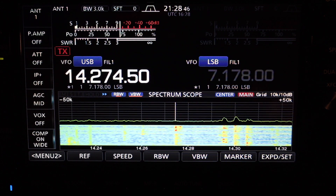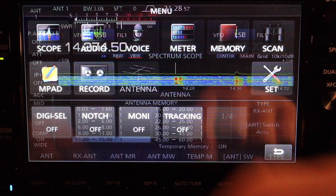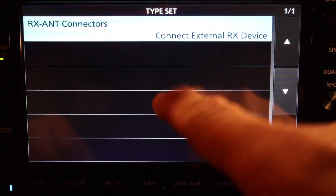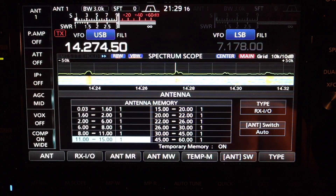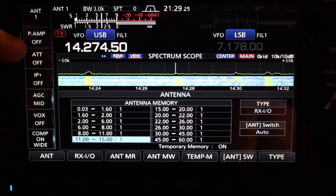Okay, got the green LED light — it's lit up, connections are made. Let me show you the setup. In the antenna menu, I'm going to select the antenna type as the external receive device, because it's basically a receive preamplifier loop antenna. Looking up here, I'm getting front-end overload. We're on 20 meters, preamp is off, attenuation is off.